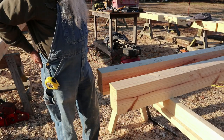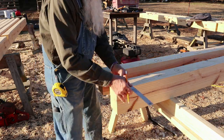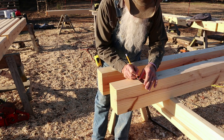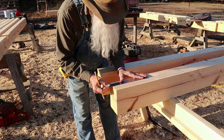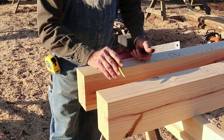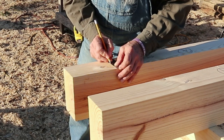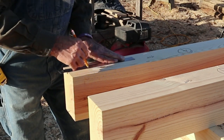Okay, we're back at the peak on the top of the rafter. What I'm going to do is measure the thickness of each of these — they're pretty close together. This one's measuring like four inches and a sixteenth. So what I'm going to do is come in from one side, a little over two inches — two inches and a thirty-second — and draw a line down the top of that. Just connect those little points together. Now I'm going to cut off of this side. And I'll do the same thing here. This one's just a little bit thicker, about a sixteenth — I'll mark it two and a sixteenth.